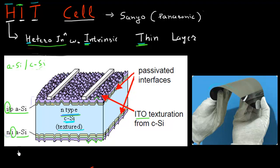A key advantage of making the junctions inside these amorphous silicon layers is that you don't require high temperature to activate or diffuse the dopants inside the solar cell. Compared to other traditional designs, this whole solar cell can be processed at very low temperature — the process flow can be realized at a temperature of around 200 or 300 degrees centigrade. That allows making these cells on very thin silicon wafers, which are less than 100 microns in thickness.